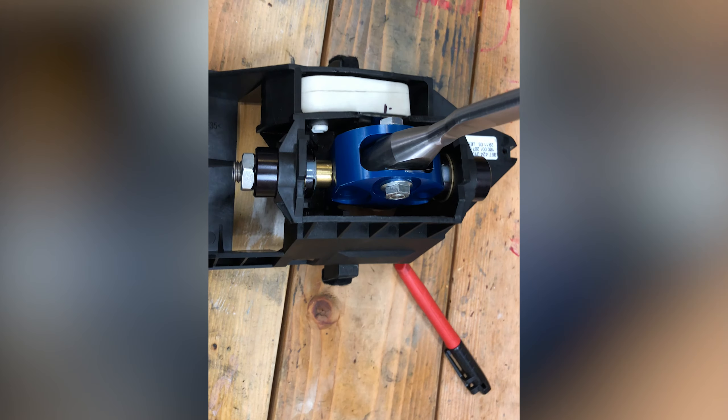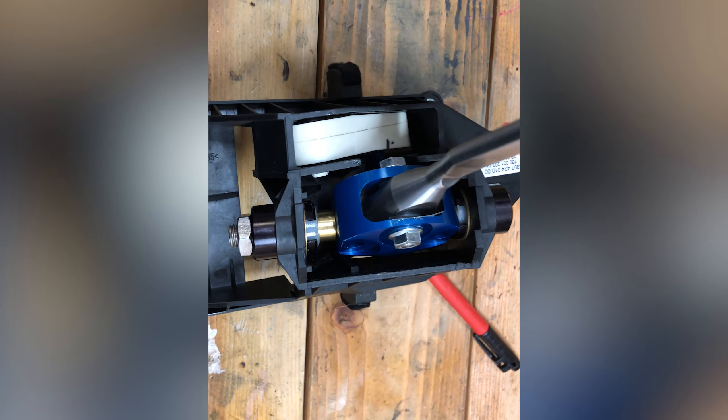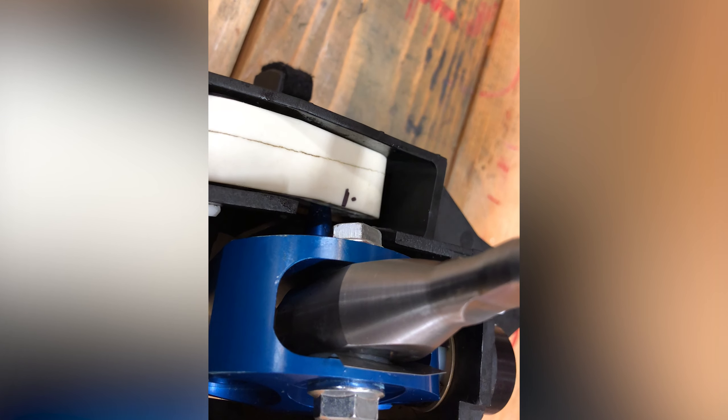I got a little insert shaped out here. I'm going to go ahead and get it epoxied in, get it dropped in there, then re-square it up with the mill. I've got a piece of Teflon to go over the top of it. I've scored it, undercut it, got some negative cuts in there, sanded it real good, cleaned it up — hopefully it'll work once it's done drying. I'll run one more pass through the mill to square it up and dial it in right to the perfect size of the ball on the end of the shift knob.